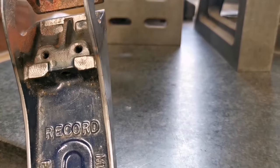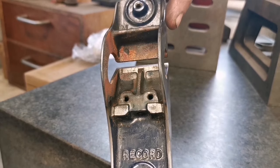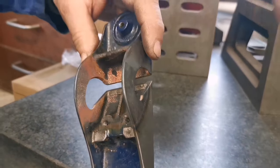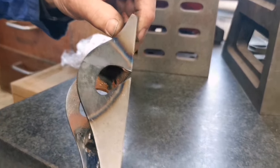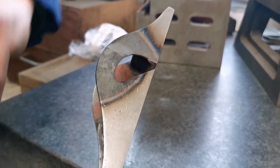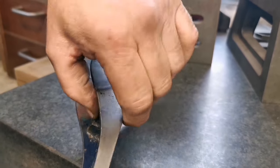Where you look at it that way, this face is a little bit out of shape. This has come in. Yeah. That was bent in. This has come in, and then you've got a bump, because it's got the support from that. You've got a rib across there, because you can't move on the rib. It's solid. So that's showing a little bit of rub there and a little bit of rub there and there. So what do we do now? Turn it over and have a look at that side.